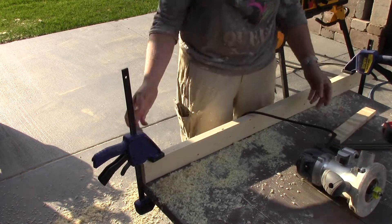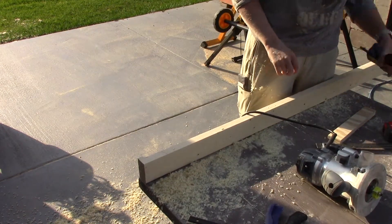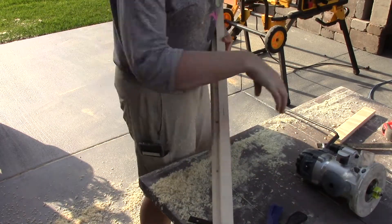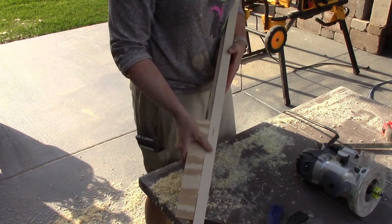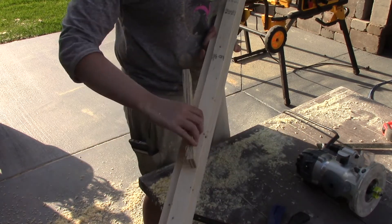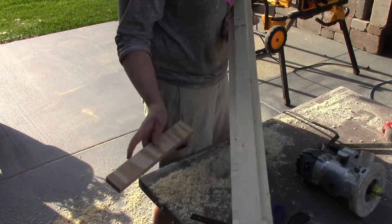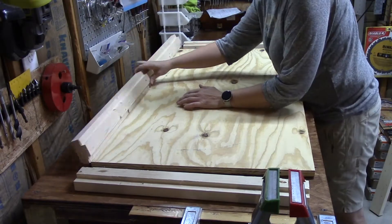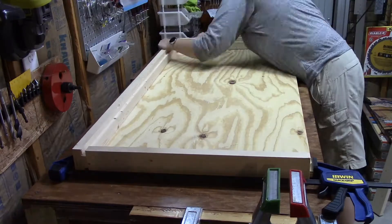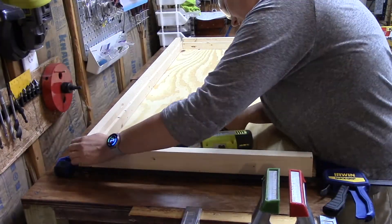Once I'm done making my cuts, I will use my scrap piece of plywood and measure to see how well it fits. When you finish taking out 3/4 inch from the top and the bottom, your board should look something like this. Instead of using pocket holes like you're about to watch me do, I'd recommend drilling in screws from the outside in using a countersink drill bit — that's what I ended up doing after I did this.